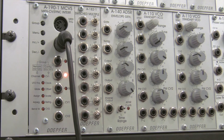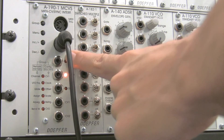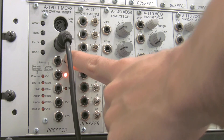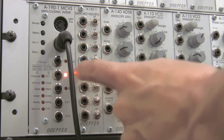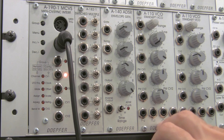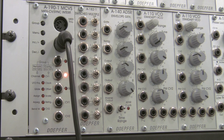Via an external source, I have notes that are going to be sent into the MIDI in. Since I'm working in a Doepfer A-100 G6 case, internally it's routed such that the notes fed in here are going to go to both the VCOs, and then the gates coming in are going to go to the A-140. This will make a little more sense once we start hearing things, but I wanted to mention it so you're not wondering where all this stuff is coming from.